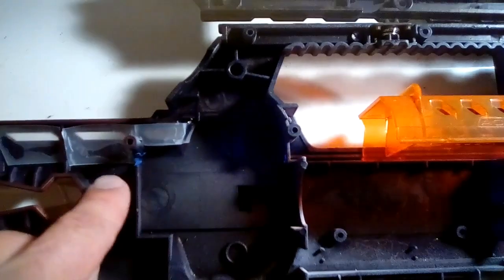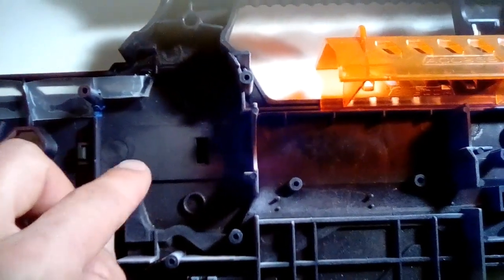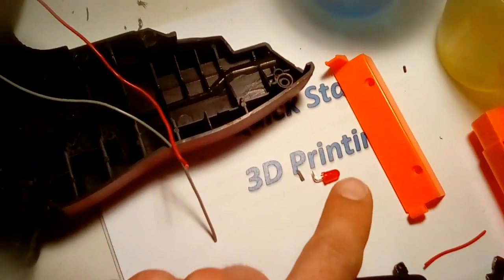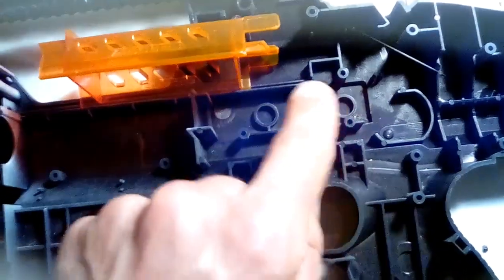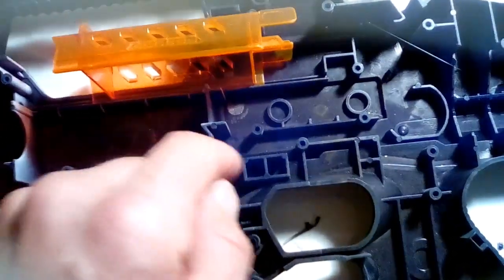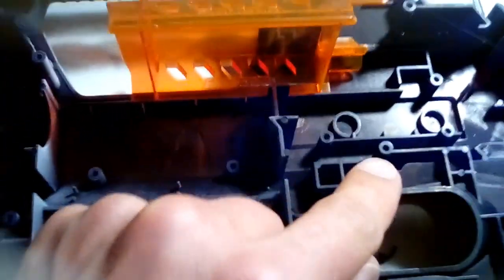And then I'm going to link those up together, so basically all four of these will be linked together, and then I can run just a single positive and negative LED lead down here into the wire way tray here, which will be covered up with this little plate here, and then it feeds down behind all the other components. There'll be a trigger component and then the dark flicker component here. It's going to run behind all this stuff and then tack on positive and negatives here.